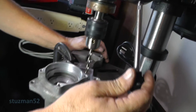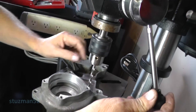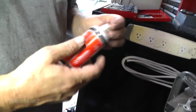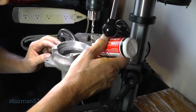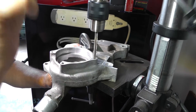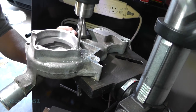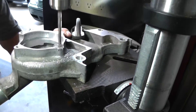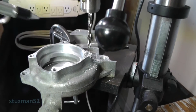Basically I bring my drill press down until I touch the top of the work piece, then I put it on zero and then I go another half an inch. This is cutting fluid — even in aluminum, even though it's a soft metal, you always want to put some kind of cutting fluid. That's a half inch. Now we want to blow the filings away.